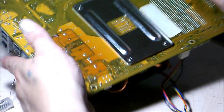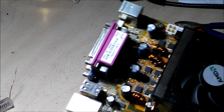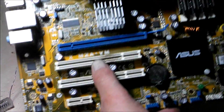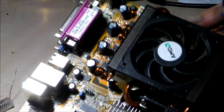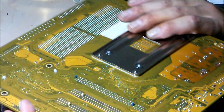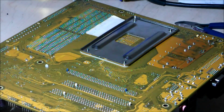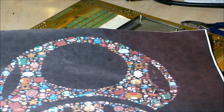So now we're done. Replaced those 4 capacitors right here with the same values and voltages, but they're a little bit bigger so they should withstand everything. This is an Asus M2A VM motherboard - got it going. In another video I'll show you that it works, and the LG monitor that I did today - that one's good to go too. Thank you guys for tuning in and watching. We'll see you guys in the next video.